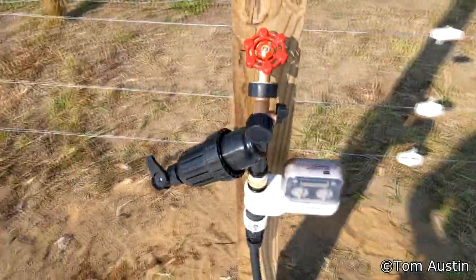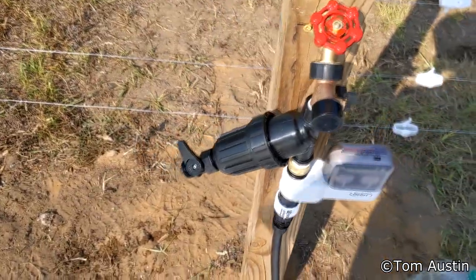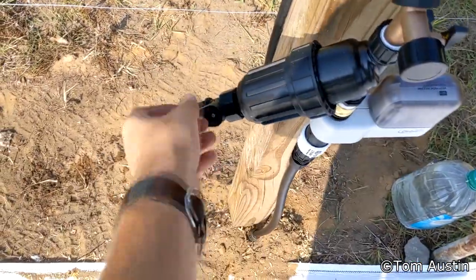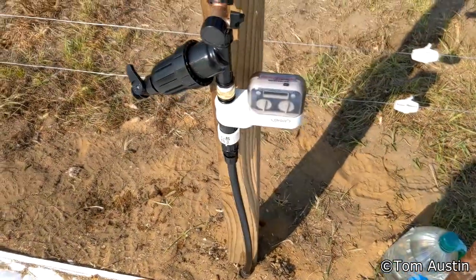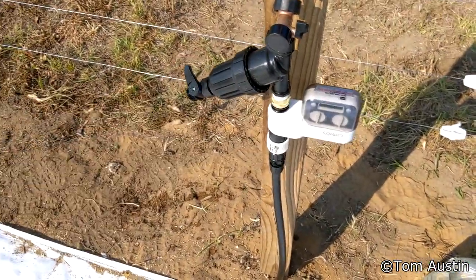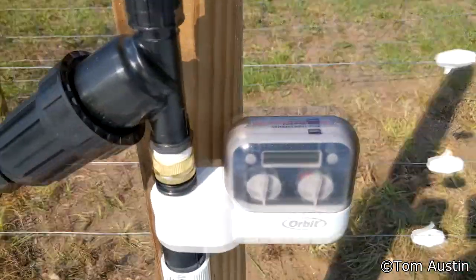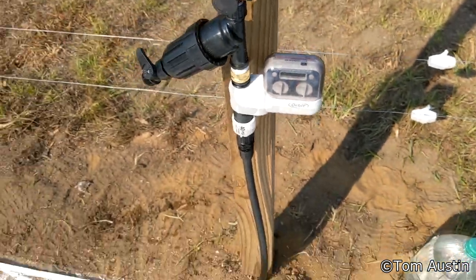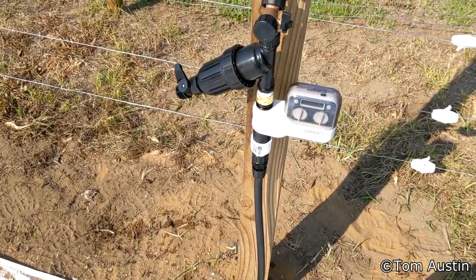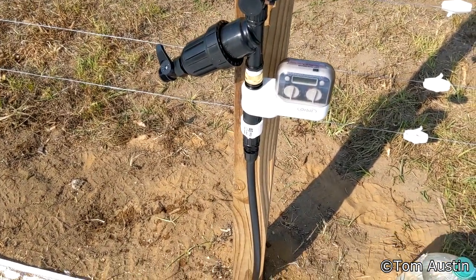That goes down to a 3/4-inch pipe thread, or sorry, a hose thread flushable filter, so I can just open that, blow everything out right there on the dirt, create a nice big erosion hole. I can turn that if I want to, but I'm going to leave it right there. That goes down here to this Orbit timer, which I forgot the batteries for, so it's not going to work. And then that runs down here to a 40 PSI pressure regulator,